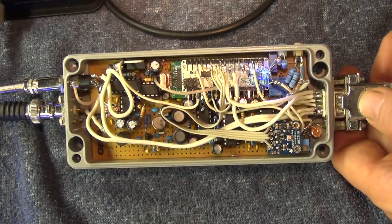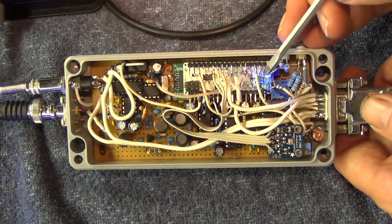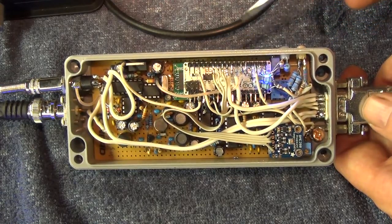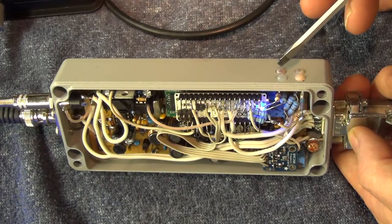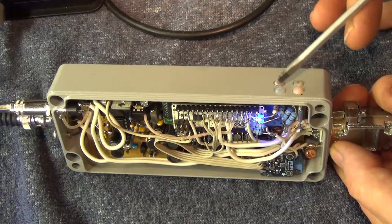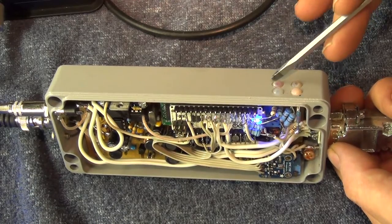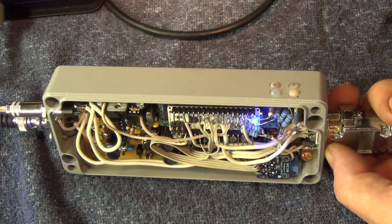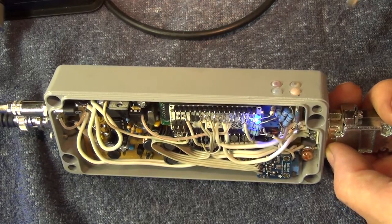The Navtex information comes in at, I think, 100 Hz. And so I have a very stable time source here — it's an interrupt timer. Once the information is fully received, there are two ways: either the blue LED turns off, meaning the message was received correctly, or the red LED switches on, meaning I got no valid termination signal or no valid ending of the passage.